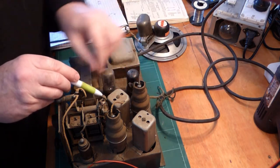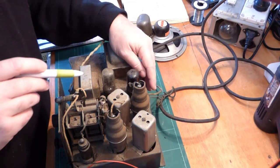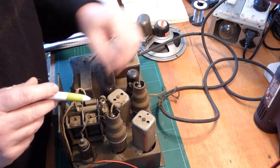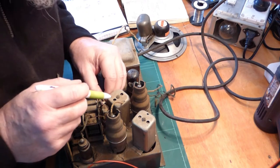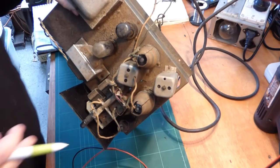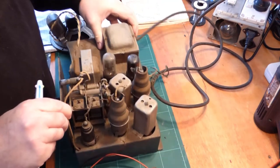The aerial wire is tied up in a knot here at the top and wrapped around these other wires. In fact there's a bit of string tied through two holes on the chassis that holds that down. I don't know if that's factory or if someone's added it after the fact — it looks like it's been there a long time. The aerial wire comes in to an aerial coil tucked in behind the tuning gang — it has a wooden former and a little half-round piece.